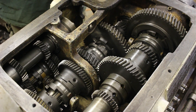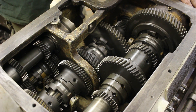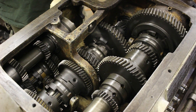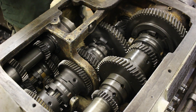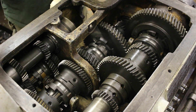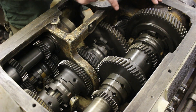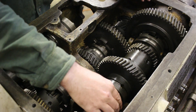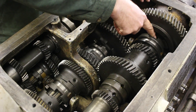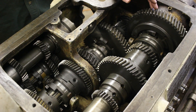In addition to getting the spacer between this main gear and the bearing in the right spot, there's an oil sling ring inside here. When I was driving the shaft in and out I dislodged that, so the bearing was not sitting all the way up against the end of the shaft like it should. That shifted the whole shaft forward so my gears didn't line up. Now I'm ready to start putting this back in permanently. I need to put the pins in here and the set screws in to hold this ring, and then that should hold everything in for the shaft.